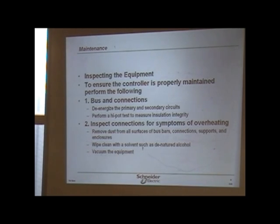He doesn't have to figure out how many conductors there are, or the length of the runs. He's already done that when he did the settings for the breakers and so forth. So it should be a little bit easier, or a little bit cheaper, to get that arc flash analysis that helps you guys out when you go out there. And that arc flash analysis is going to tell you the category of PPE that you require, or how much protection you require to work on this equipment when it's energized, or if you're going to do any kind of switching on this equipment.